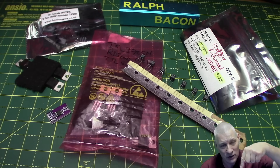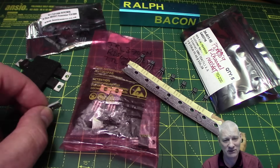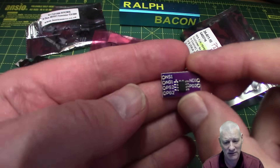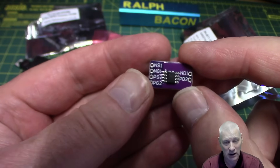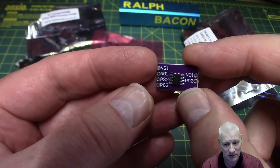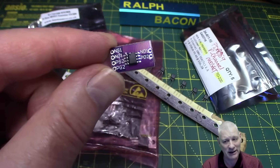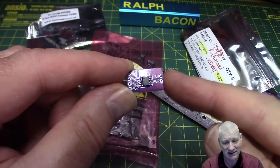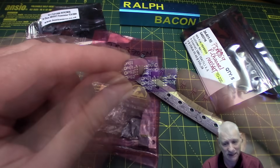I've put a couple of links below this video where you can buy MOSFETs cheaply for use in general Arduino circuits, and they're absolutely fine. If you do need higher-powered ones for any reason, you probably already know why and will be taking that into account. Before we get to the whiteboard, here's a little dual-chip MOSFET — the SI4599. There are two tiny MOSFETs in here: an N-channel and a P-channel. They're on a small board so you can add header pins and plug them into your breadboard. You can get ten of these for about a dollar apiece from the Far East.